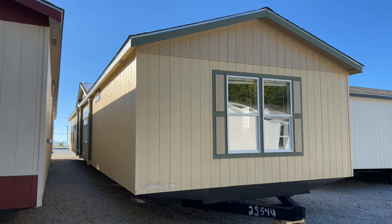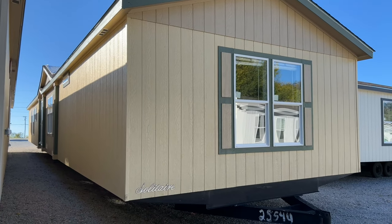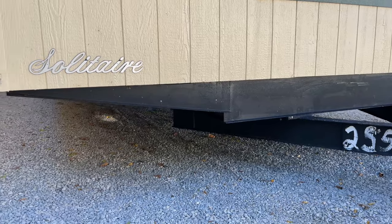So let's go around the outside, take a look at the inside and show you what this house has and why it's such an amazing house. Here is the Solitaire HD 284 — an amazing 18-wide floor plan. With Solitaire, we're going to start right at the frame. We have a 12-inch I-beam with full-length outriggers, meaning this piece of metal goes all the way from the frame to the sidewall, carrying the whole weight of the sidewall along the entire house.